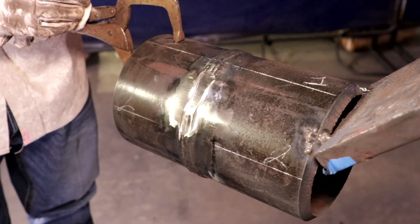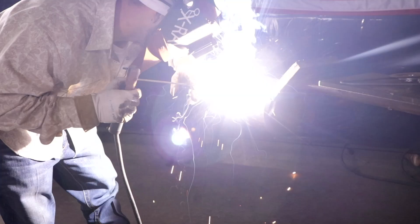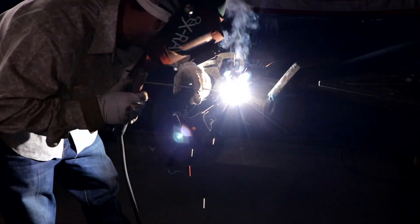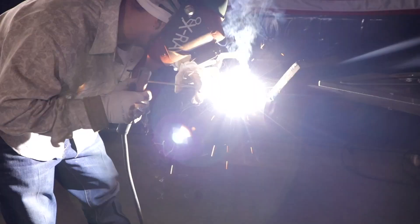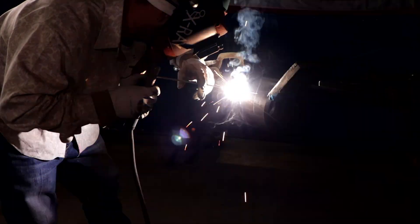You've got to make sure that you match the other weld. Let's just go ahead and cap this out. Also, one thing to take into consideration is when you're doing a cap, make sure to pay attention to what side the previous cap was started on. In this case it was the left side, so I'm starting there and moving from left to right. You want your cap to match theirs as much as possible.